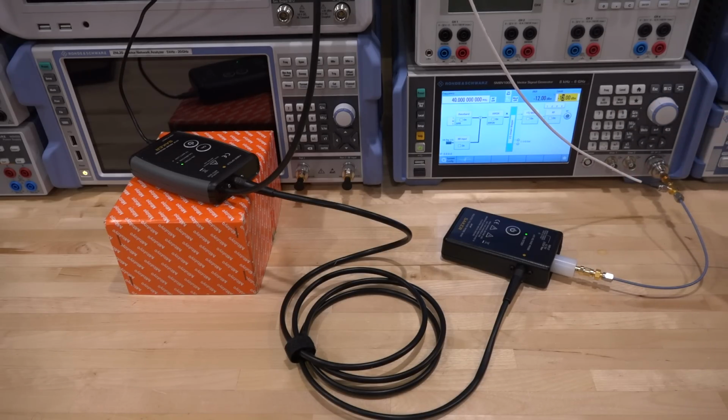There's another advantage here, because by looking at this signal and this signal simultaneously, the one that's processed through the probe can then be compared with the raw measurement, and therefore any of the nonlinearity of the oscilloscope, for example, can be eliminated as far as making sure it's not the limiting factor. And that's going to be quite useful in this measurement, because you really want to measure only the probe.